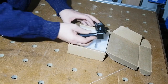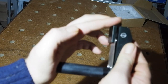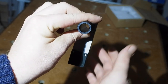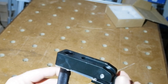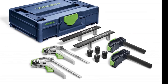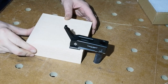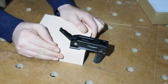Let's see if this little beauty fares any better. This is a new brand to Banggood called Ganway, and this is their hold-down clamp. I have the 20mm dog hole version here, but it's also available for 19mm or three-quarter inch holes. There's no messing about with materials: it's all metal - body, stem and cam lever are all aluminium, with a piece of spring steel that has a black anodized aluminium clamping foot at the end. Lift the cam to push the foot down. At the time of filming these hold-downs are selling for a little over 12 pounds each - for the build quality, that strikes me as phenomenal value. Max clamping depth is said to be 60mm, and this piece of beech is 52mm. The stem is all the way through the dog hole with not much poking through the underside of the bench, but there's good grip there and more left on the cam.